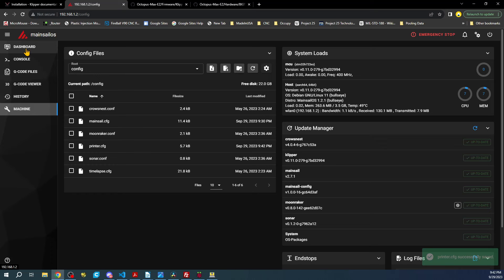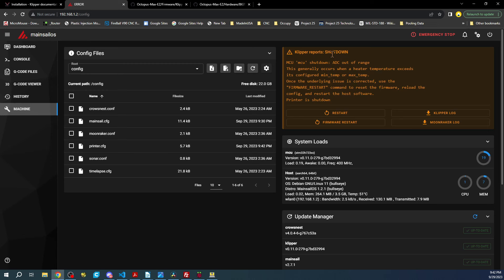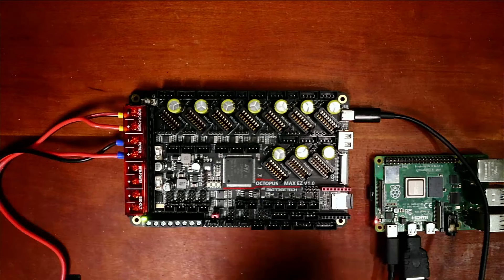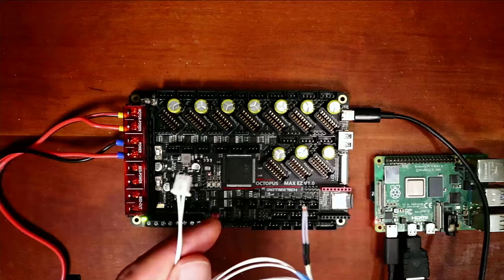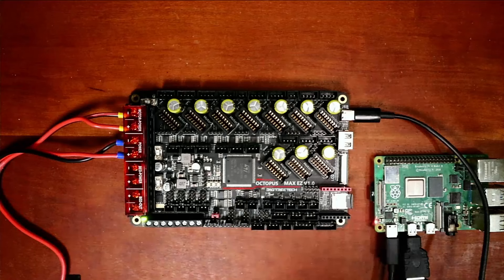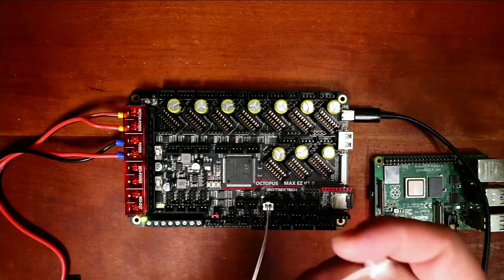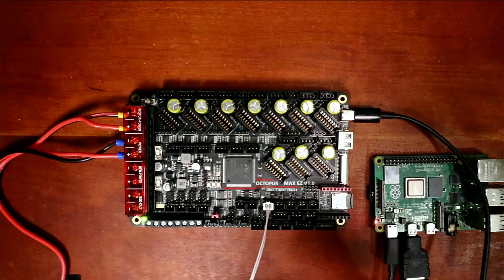It's still going to have an issue — you can see it's reporting a shutdown. It says ADC out of range, which has to do with thermistors. We're going to grab two thermistors to demonstrate. This is a glass bead thermistor with two wires — the resistance change with temperature is how it measures. I'll plug one in for the heat bed and one for the hot end thermistor, just to demonstrate. Your printer will have these as well.